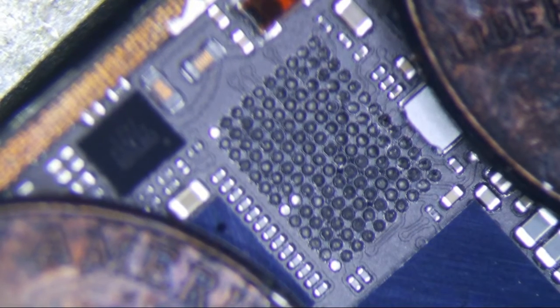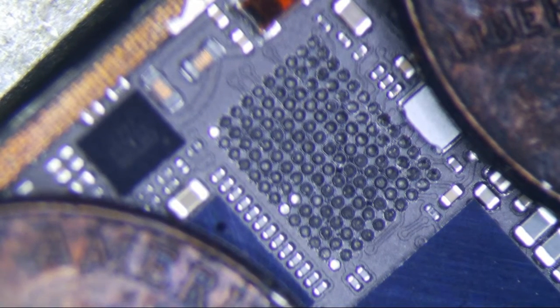It took about 40 seconds to remove the chip. I think that's probably your goal — some people do it a little bit faster, but I don't really have a whole lot of secondary defects anymore like overheating the other side of the board. That's my sweet spot, but do what works best for you.